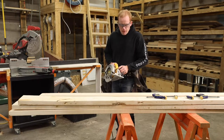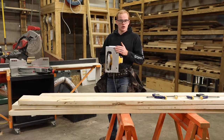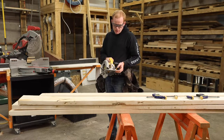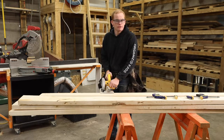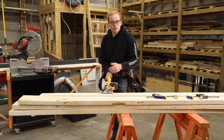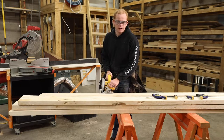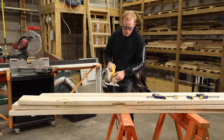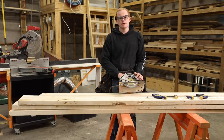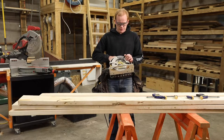The first safety tip is that your base plate of your circular saw has to be touching the wood before you start your saw — every time. The second thing is that your blade needs to be running full speed before it touches the piece of wood. Third: blade height. We don't need to be exposing more blade than necessary when we're working with the saw.